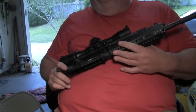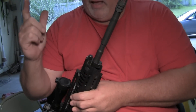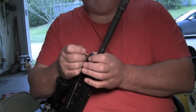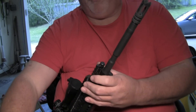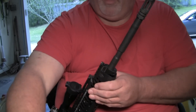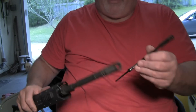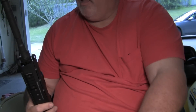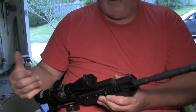The only difference between this rifle and our standard M4 is the gas system. Basically to take this one down, you push this pin in and rotate it to the right side of the rifle one quarter way — that releases it. You can pull this straight out, then tilt the rifle down. The operating piston — the gas piston — will come out, and you can clean in here. Just a simple wipe down; it stays fairly clean.